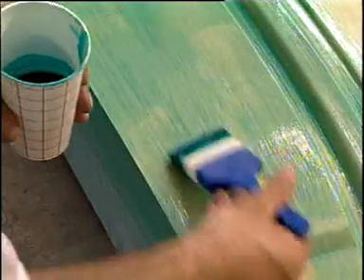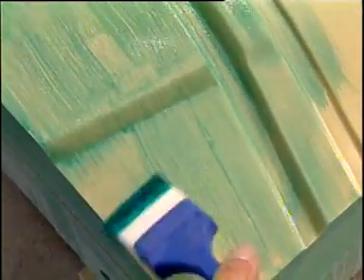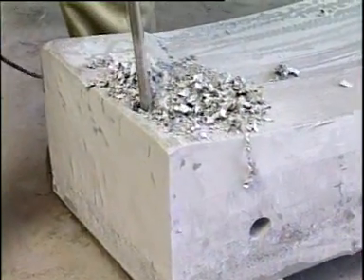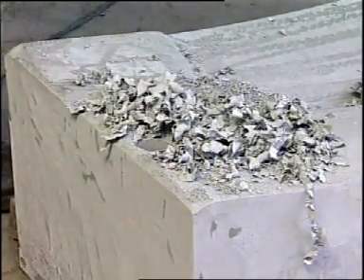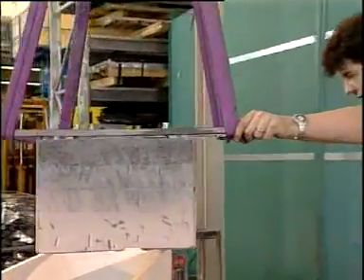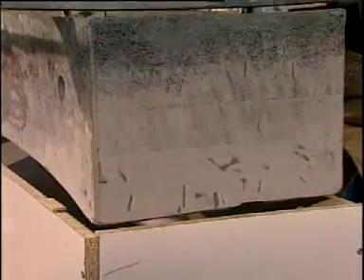After application of a PVA separation film on the wax foil, the now hardened tool core is first mechanically roughened to ensure optimum adhesion of the front layer cast, and then the casting and bleeding channels are drilled. The punch and the die are joined and prepared for the front layer cast. A distance of between 10 and 15 millimetres is recommended.